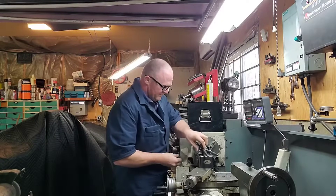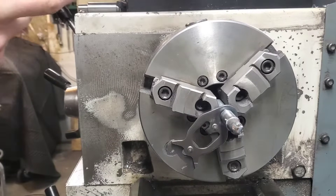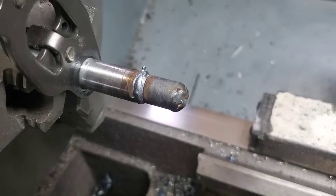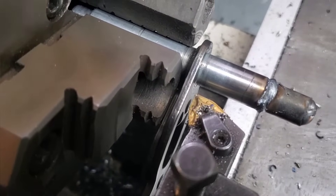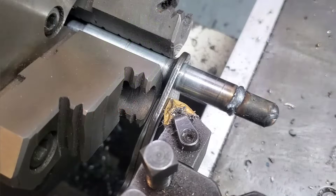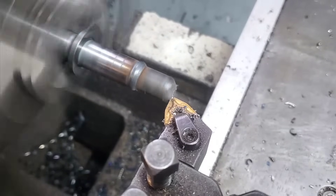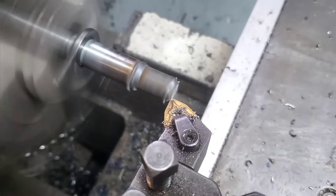Back out of the cold side shop and into the warm back shop. This is where the really fun part of the project starts — turning it down to the actual dimension after welding. This weld turned out quite well and I'm very happy with it. I'm gonna touch off on that side shoulder, zero it, measure off the other part I have, and make these lengths pretty close to the end dimension. Remember the lengths aren't overly too important for a shifter knob — what really matters is that outside diameter.